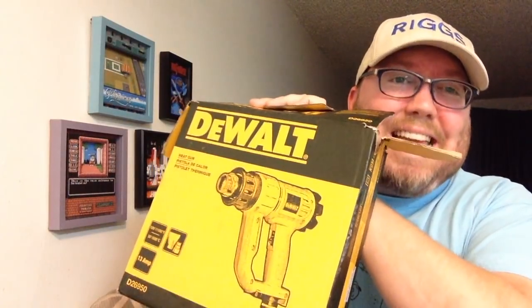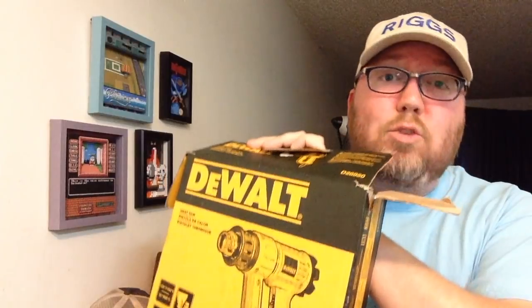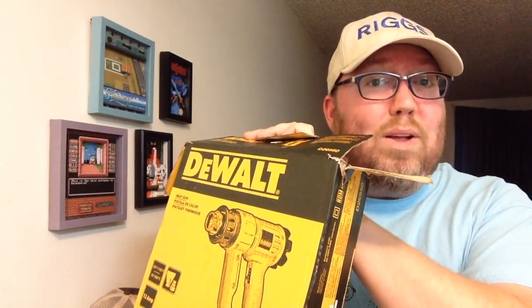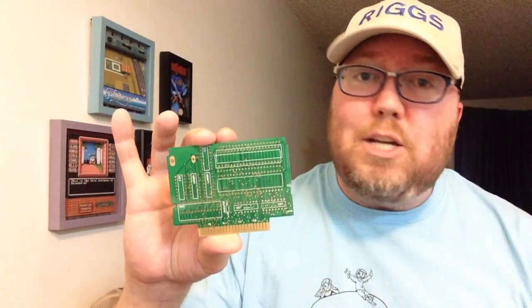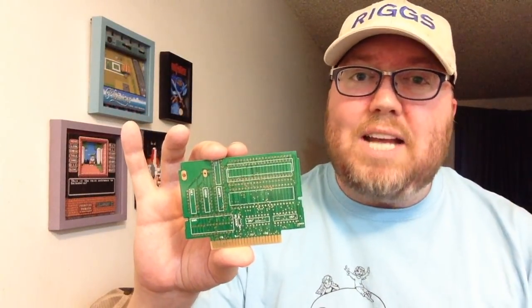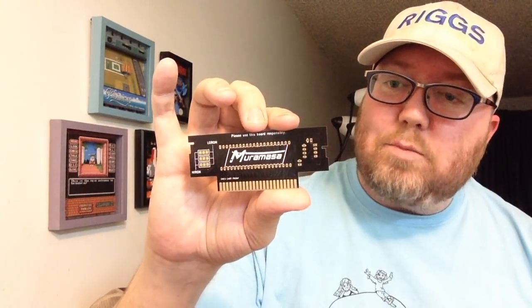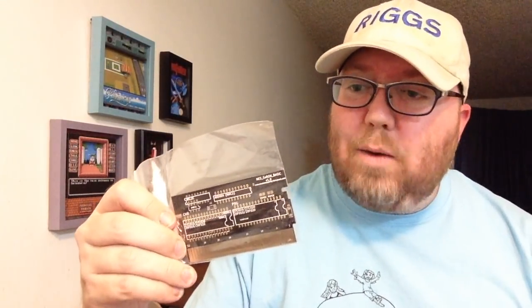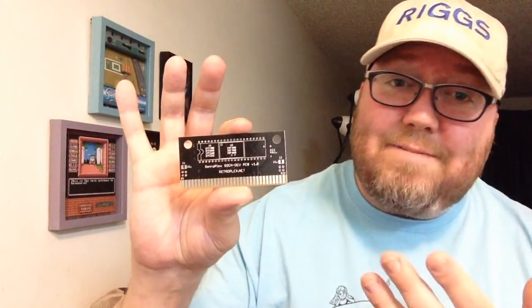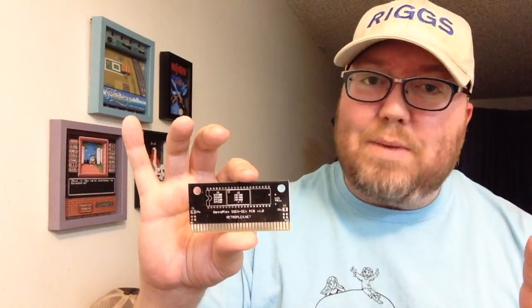This is one of those things you don't really need, but I bought one anyway — it's a heat gun. You can heat up the labels of your Nintendo carts to peel them off really quickly, though you can do that with a blow dryer as well. The only problem is you can't leave it on the cart too long because the cart will warp. And again, you don't need to destroy any more games to make repros — you can use brand new parts. This is a Super Nintendo board; you have a spot for a battery, pop the EEPROM in, and you're good to go. RetroStage.net, Mortoff Games, and others carry these circuit boards. Here's a quick look at a 2-meg SNES board from Muramasa — they also make new boards for Nintendo, including SL-ROM and SK-ROM boards for games like Holy Diver. And this is that 4-meg Genesis board — with this you can make pretty much any Genesis game, from Streets of Rage 2 hacks to 1-meg and 2-meg titles, as long as it doesn't require a battery.